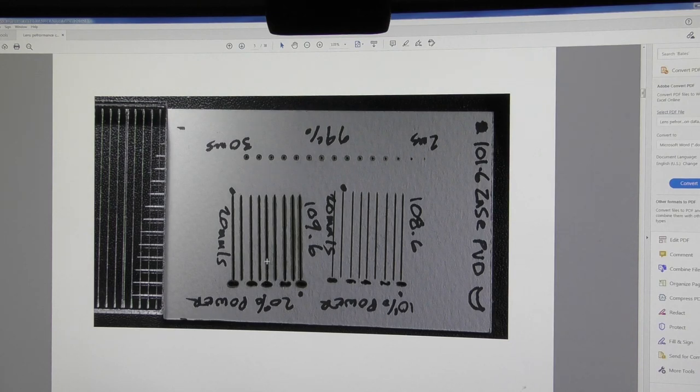This is proof positive that we are not dealing with a fixed focal point. If we were dealing with a fixed focal point, the line thickness would not change because all the rays are passing through one specific point, something called the spot size.